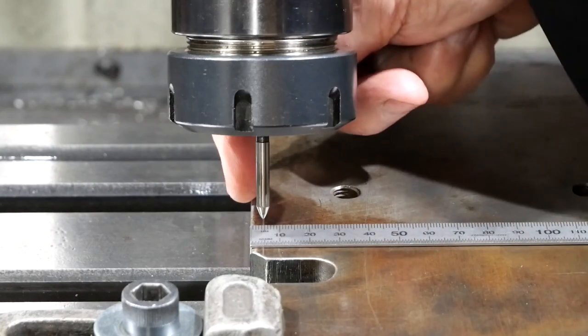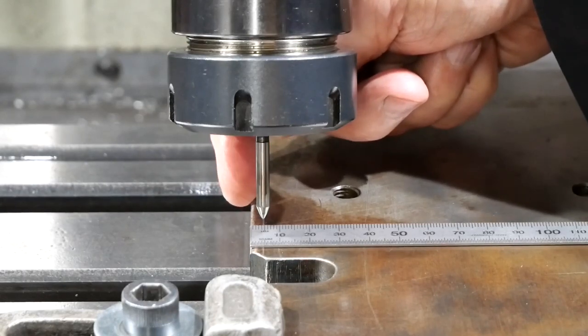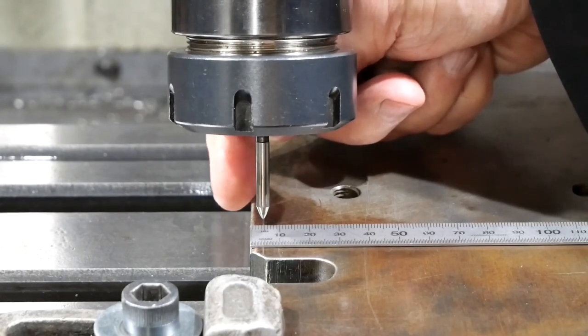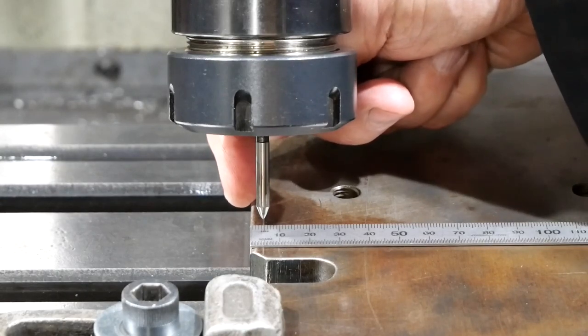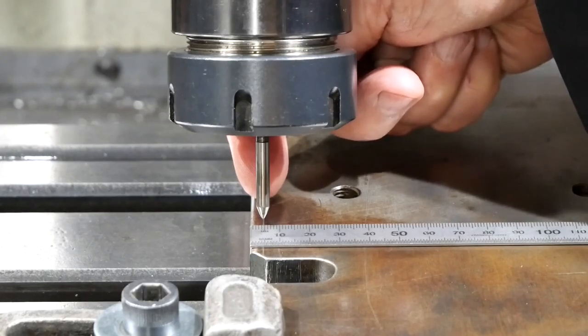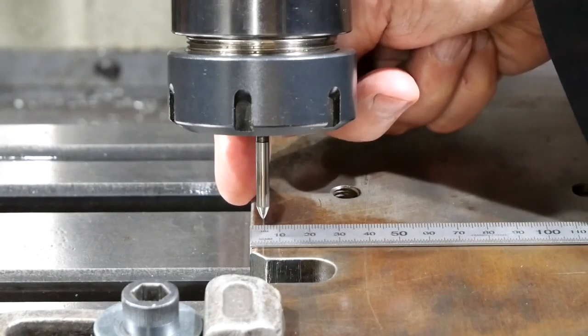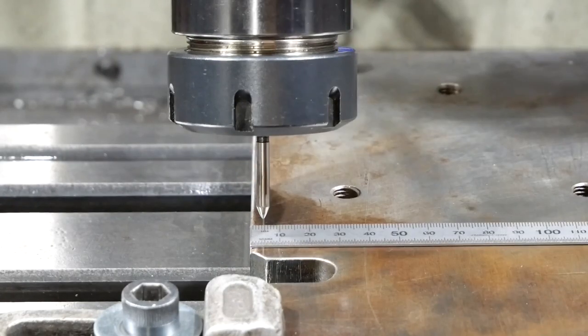The issue that I'm most concerned about is the rounding off on this corner. That may well result in my thing not working. And if that's the case, my countermeasure is going to be to mill off a millimetre or so to get rid of that rounding and basically set the bar slightly lower. Anyway, fingers crossed, let's see how it works out.